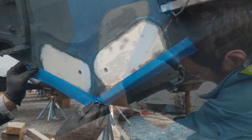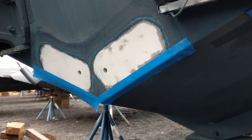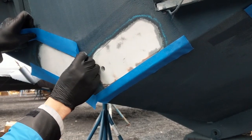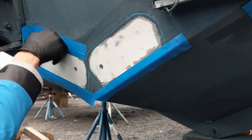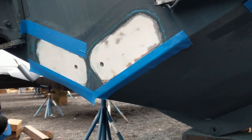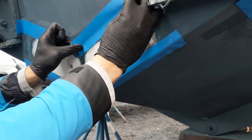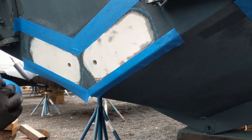Go around with your thumb to make sure the tape is nice and tight — you don't want caulk getting underneath the tape. I'm doing the same thing to the MIU-15s on the back of the boat. We sanded everything, feathered it, re-templated, and now we're taping again. This shows you the method for masking everything so you get a nice clean caulk boundary.